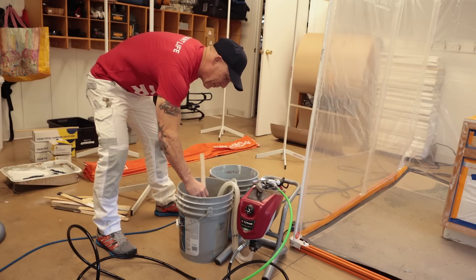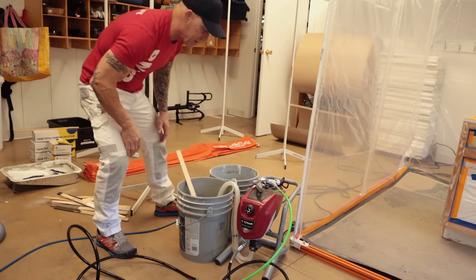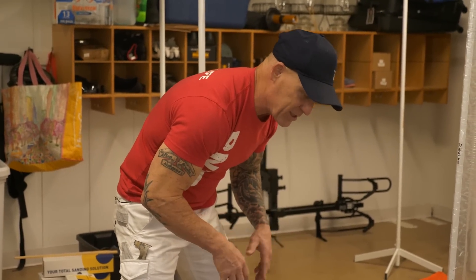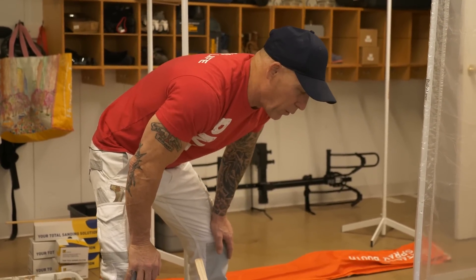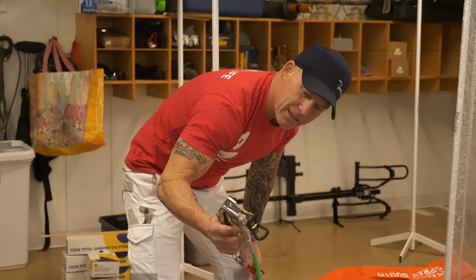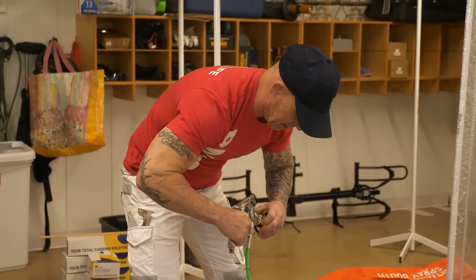In viscosity, it's about how we would spray oil-based trim paint back in the day. If I was going to put it in an HVLP sprayer, I'd want to measure exact viscosity using a Zahn cup or Ford 4 cup, but I'm not spraying through an HVLP. I'm spraying through the Titan Control Max, and I'm even going to use the gun that came with it. So let's get this thing loaded up and ready to go.